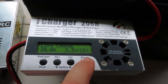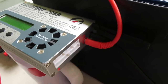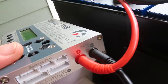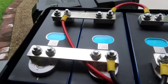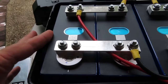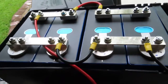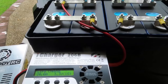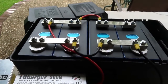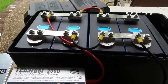We're going to start this up. The leads connected to this charger have banana plug terminals — I hacked the ends off and put some eyelets on there. I've got the positive lead connected to the leftmost battery and the negative lead connected to the rightmost battery. That helps to balance the cells — keeps the electrons flowing across all four of those cells. That's the way to do it with a power supply or whatever you're using to get the initial single-cell top balance.